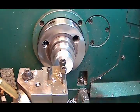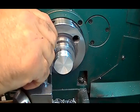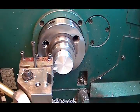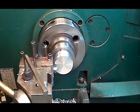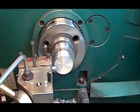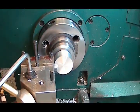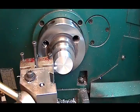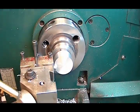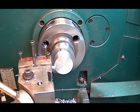Take my other tool bit that I got set up here for turning in against the shoulder, and I want to turn my tool holder at a bit of an angle because we're going up against the shoulder now. And I'm gonna make sure I got clearance here a little more, just setting a little bit of an angle so that the back of the tool doesn't rub. Okay, that'll do. Set my zero over here, and it's 250 in from there.